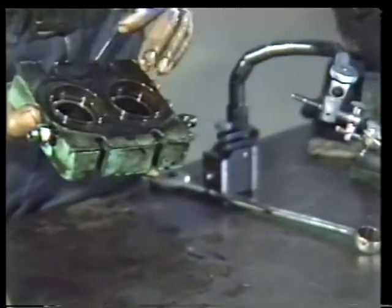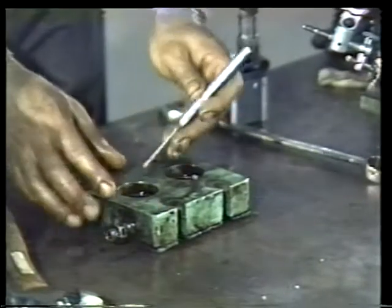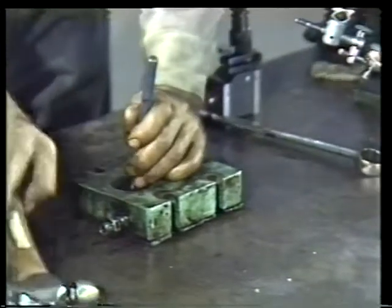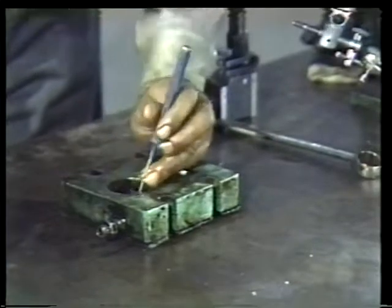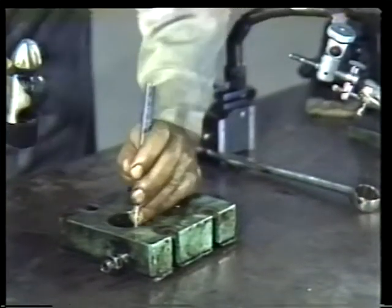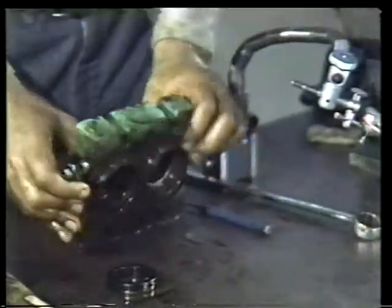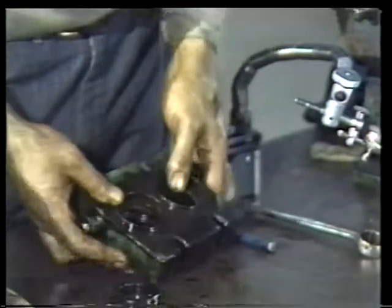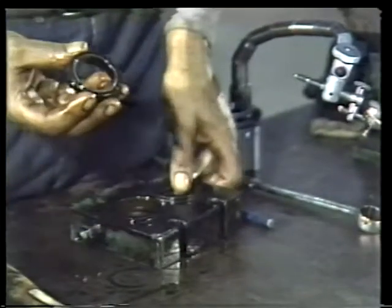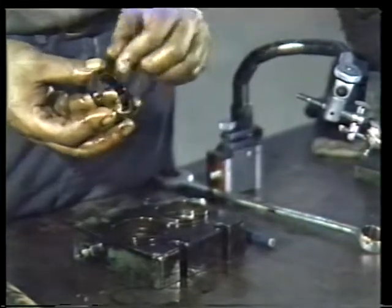As we mentioned before, the worn stationary sealing faces have to be removed from the seal plate that we took from the inboard bearing bracket. One way to do this is to tap the stationary faces out with a hammer and punch. Even if this stationary face were in good condition, it would have to be replaced along with the other parts of the leaky seal. An old stationary face can't be used with a new seal.